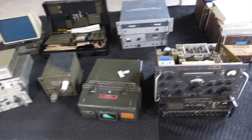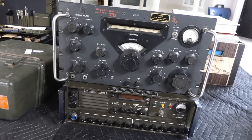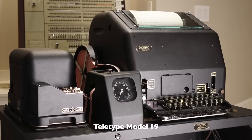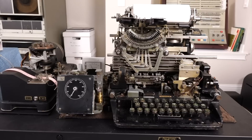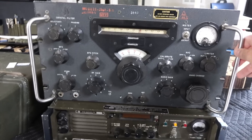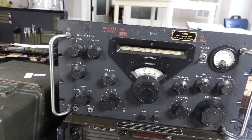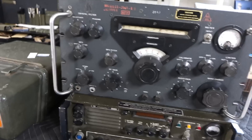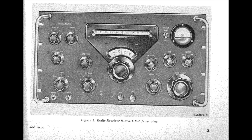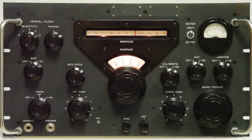Let's start with dessert. This is what I was after when I went to the Hamfest — military radios. That's part of a bigger effort to put my Model 19 teletype back on the air, as it was when it was on a ship, and I wanted some period radios. Here's the receiver: I didn't go for the R390, which it was probably attached to, but for a more affordable yet absolutely spectacular R388. The Collins R388 is a 1950 radio that was designed specifically for radio teletype operation rather than voice.